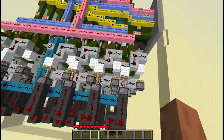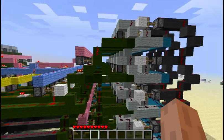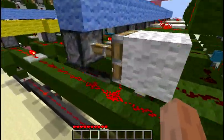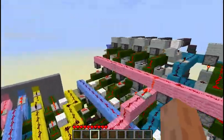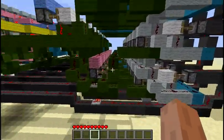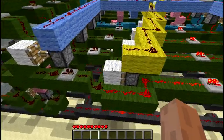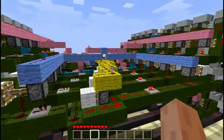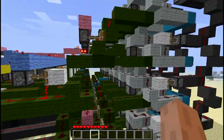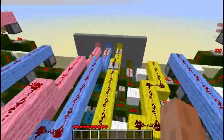One row is a byte. And these are multiplexers — more of them — that make sure the output is routed from the right byte. That's what the pink one here takes care of. So these two are routed together, and the outputs of that go through another multiplexer, and yet again a third one from the other side. So this yellow one decides whether to take the data from right or left. The blue one here decides whether it's the top half or the bottom half. And each pink one also — top/bottom — and that routes all the data to the right place.